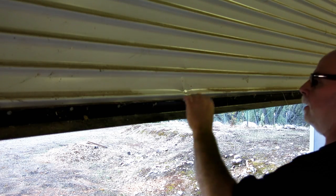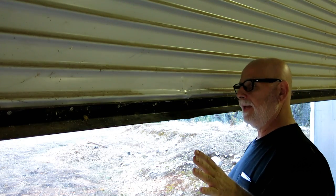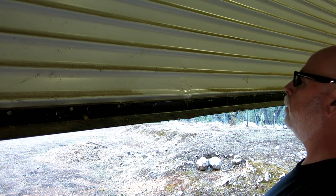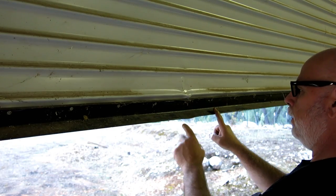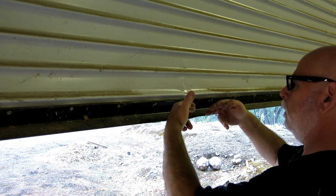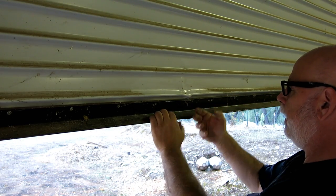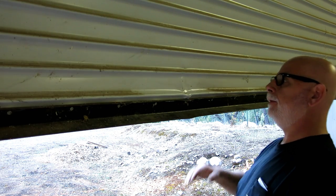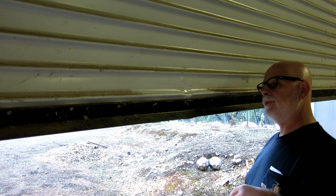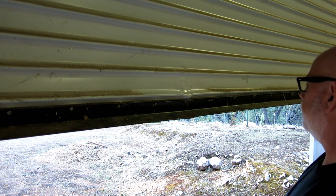Well, I made some improvements, but I don't have the right stuff. So I'm going to stop now before I cause more damage. This is a piece of steel angle here at the bottom and it's got a big bow on it — it's kicked out a little bit. What I need is a strong back to straighten this flange and that other flange a little bit. I'll bring some special stuff up to do this and hopefully cover it in the next update.